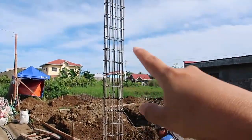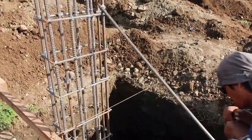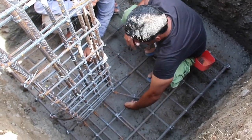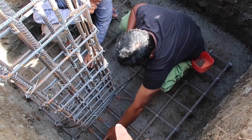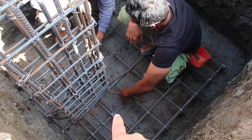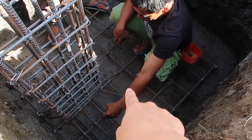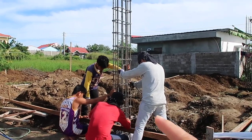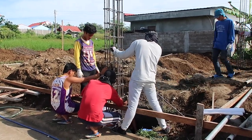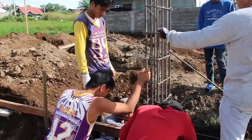You guys noticed that there are already two columns standing. On the bottom, the foreman and his skilled person are revising our beddings because my husband wanted to strengthen the bottom. As a Plan B, beside tying using the wires, they will put a 12mm rebar around it. They're redoing the bottom bed — removing the wire on one of the 16mm rebars and putting it over the top of the column feet.